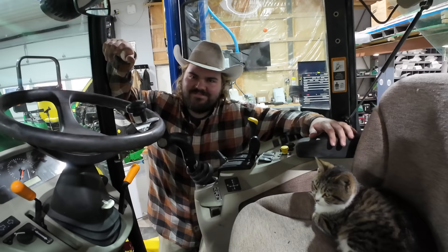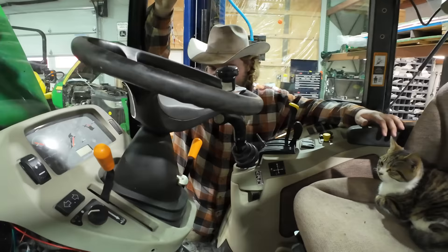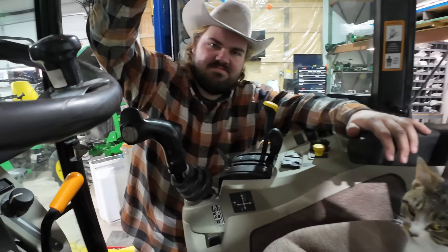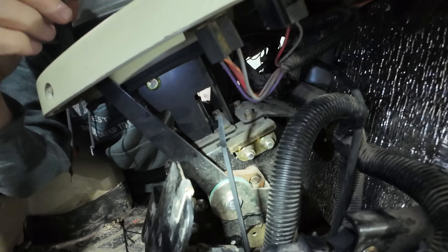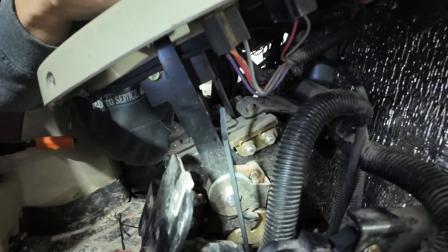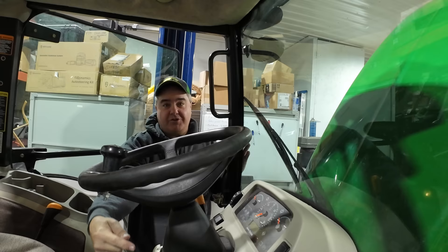While we've got all this apart, we really need to work on that throttle cable that I pushed a little too hard, as shown in an earlier episode. But I think, had we read the service manual — we haven't even looked at it now, but we just took a peek this morning — we could have prevented this. Right in here, this bar has slots, so we could have adjusted it to keep the throttle from going up any higher and would have protected that cable. We didn't know, and we didn't try to read about it. So you learn after you break something. For the rest of you guys, if your throttle cable needs adjusting, be sure to take this inside cowling off and set that stop up at the right spot.